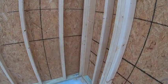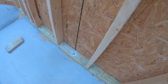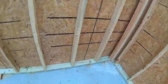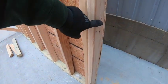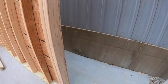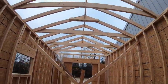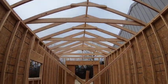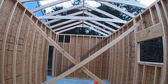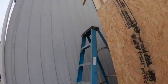Just an update — after we got the walls in we shot them with the power shotgun just to hold in place, and we did come back and do wedge or redhead anchors and drill them in. I like to leave the jack or trimmer studs out and then shoot my power shots in, and then set the jack studs on top — that helps keep that wall from moving. Of course you put an anchor close to it anyway. We're going to take these braces down pretty soon — we really don't need them now. We've got to frame the gable ends in and put our fascia boards on so we can get ready to put plywood on the roof.